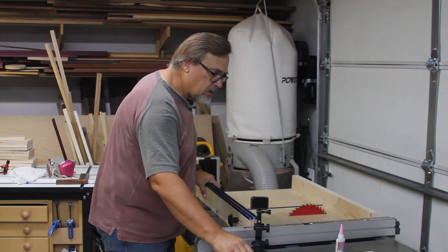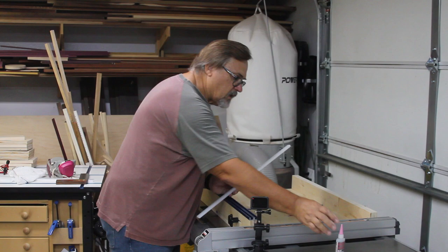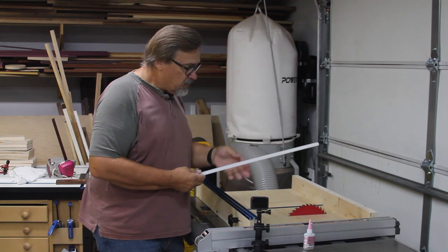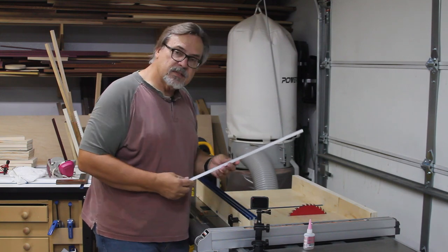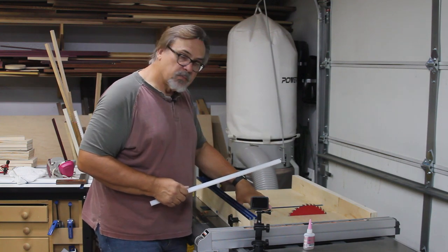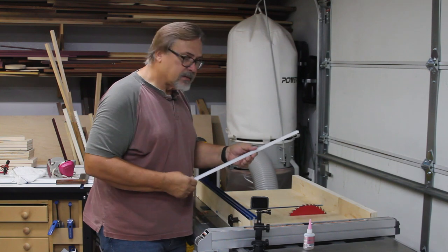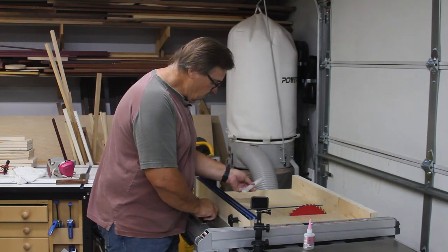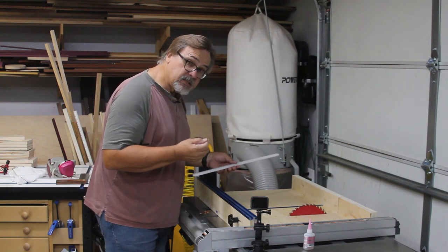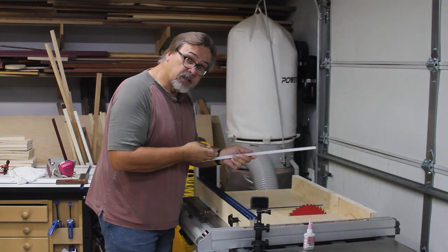The last thing I need to do is put the plastic runner piece on the bottom. I'm going to use medium CA glue to glue it in place, then screw from the bottom after it sets. CA glue works with moisture and there's not much moisture in this plastic, so I'll let it sit for a while. You only want a couple of drops — nothing that will squeeze out and stick to the sides. This runner sits a little shallower than the depth of the groove, so I need to put some pennies below it to raise it up so the sled makes proper contact when set down.